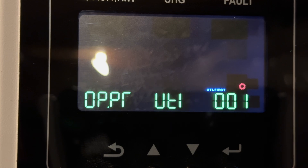Utility mode runs exclusively off the utility or the grid, without battery or solar. Sol mode is a setting in which the PV inputs and the battery power the house. At night, after the sun has set, the grid takes over, preserving the battery. This is a helpful setting during winter when you want to preserve the battery during the night in the event of a snowstorm or some other power outage.